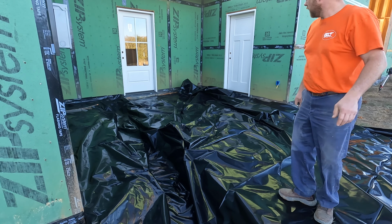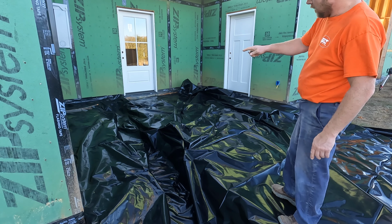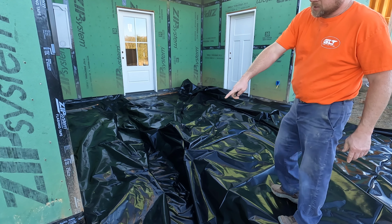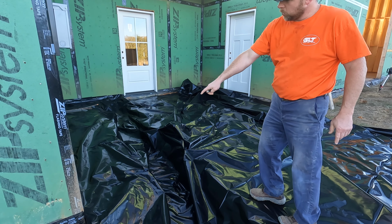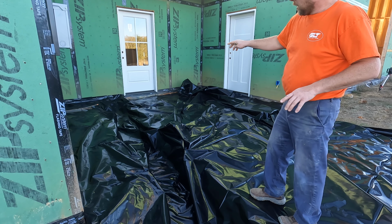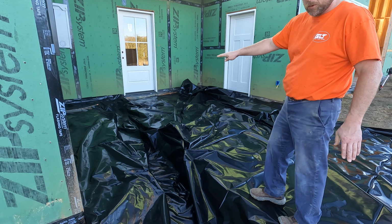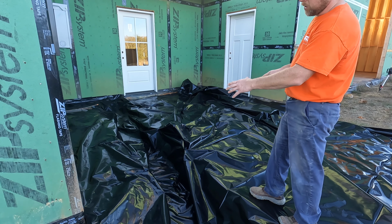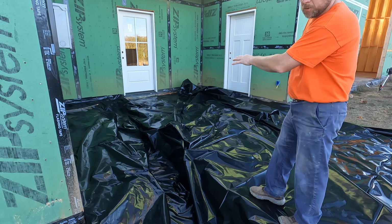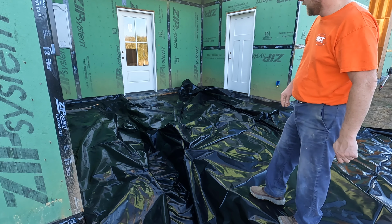All right, what I'm doing is I'm gonna essentially have every bit of this covered in plastic in here. I have French drain here, French drain over there, and sidewalk that comes out. I'll set my pads for my pool equipment, and then my heat pump will go back in the corner. But I'll take and put my drain tile in here, fill it up flush with level rock, and then once they set their pads level, then I'll come back with some kind of landscaping stone in here and put over that. I don't want any kind of mulch or anything like that.